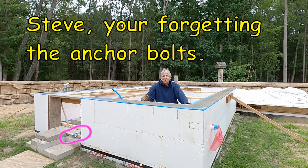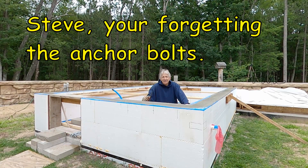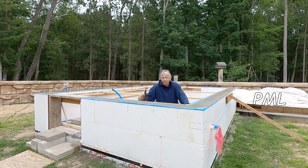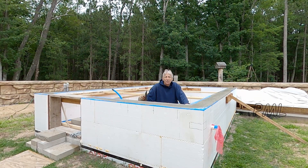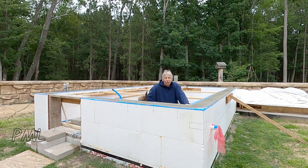That's it for the concrete pour. We did 2.4 cubic yards in a 6-inch wide ICF formed wall and everything went just as planned — nothing came loose, everything is firm and solid. We went with a 4,000-pound mix, round rock, 1-inch minus. We started out with about a 6-inch slump but ended up going to about a 7-inch slump, and everything flowed very nicely.